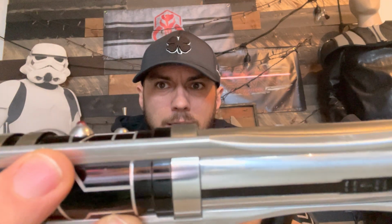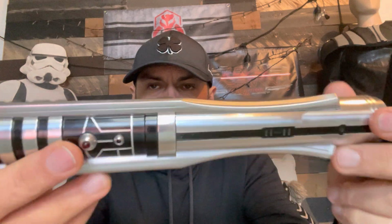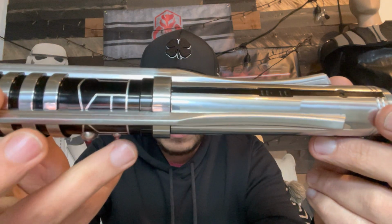You get that? That's good. So when you're putting this chassis back in, we're going to do the same thing that we did when we took it out. Don't put it in with your switches up, because you see your auxiliary, how it's pressed down right now. So we're going to want to flip it over, let that auxiliary switch fall down, and then that puts our set screw on the top anyway.